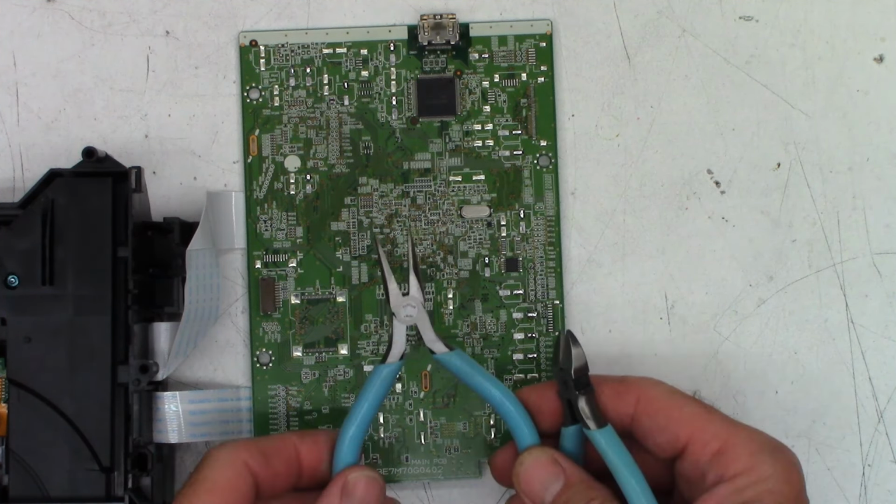I think I'll start up here on this one, which is a 330. So knowing that the negative goes to the right-hand side, based on that right there, the negative is on the right of your screen. So it has to go in this orientation right here. I'm going to bend this lead right there, and then we'll bring this one out about the distance I think it needs to be. Bend it at a 90.